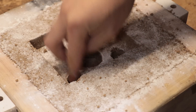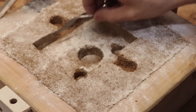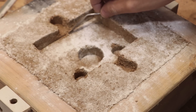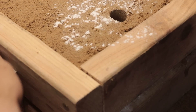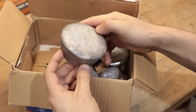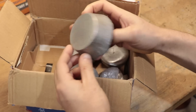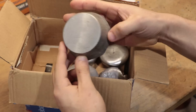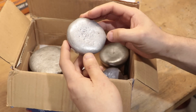That turned out a lot better than the first time around. Of course, my sculpting skills are pretty average, but this mold should work. Now for the casting, I've gone and bought some proper casting aluminium. This stuff should have a higher silicon content than what I was using before and it should be much better suited for being cast.